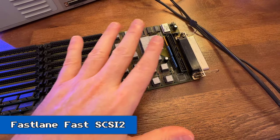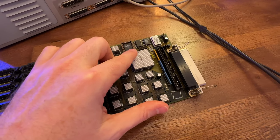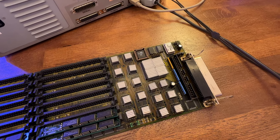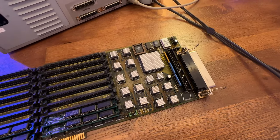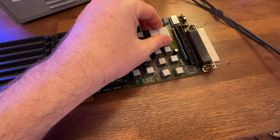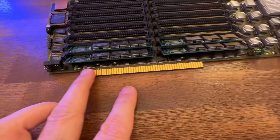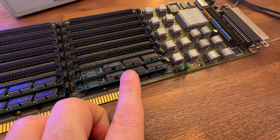On the right-hand side, this area is all to do with the SCSI side. There's the actual 50-pin SCSI connector, and some jumpers to configure whether it uses synchronous or asynchronous mode, and so forth. A previous owner has modified this board — they put heat sinks on, unfortunately aluminium ones. Originally, all of these chips had heat sinks on, which is very odd because if you put those heat sinks on, you can't actually put the memory sticks in, which is kind of bizarre.